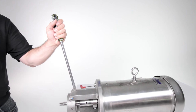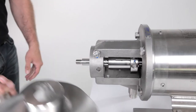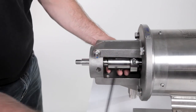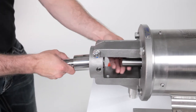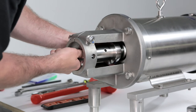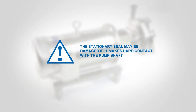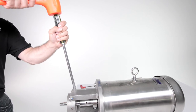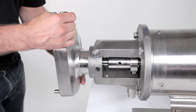If the pump housing does not come off the flange support easily, widen the flange support by driving a screwdriver into the slot on top. Place the pump housing face down on the housing studs. Loosen the shaft collar screw on the shaft collar with the Allen wrench. Pull the pump shaft off the motor shaft. To install the new shaft, align the slot of the clamping ring directly over the slot on the shaft. Then slide the new shaft collar onto the pump shaft, but do not tighten the shaft collar screw at this time. Slide the pump shaft and collar onto the motor shaft. Carefully slide the pump housing over the pump shaft and back against the flange support — the stationary seal may be damaged if it makes hard contact with the pump shaft.